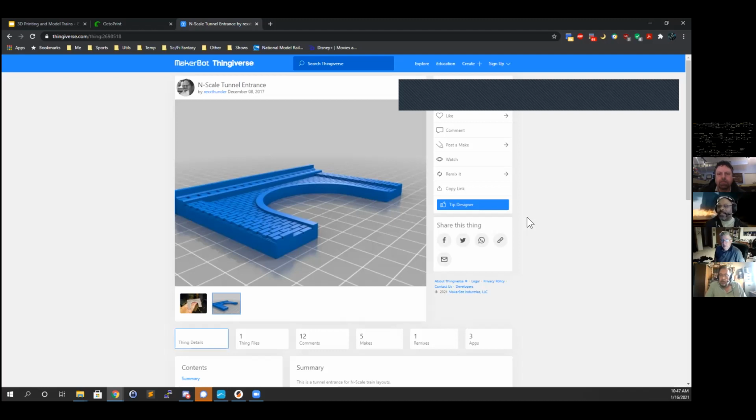The issue with that is that sometimes it won't stick in some places, and in other places when it tries to extrude, it's so close to the bed that it can't extrude anything, so it doesn't lay down any plastic. So little things like that I learned from the first printer over time. But don't get me wrong, a small printer like that is great.